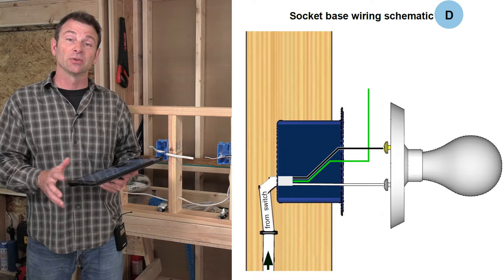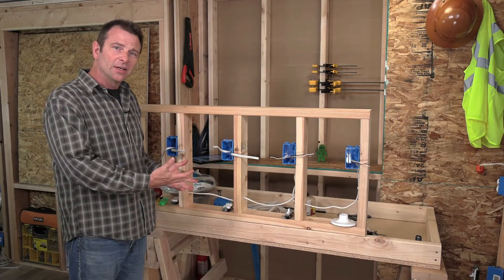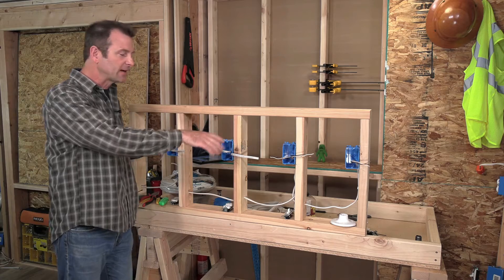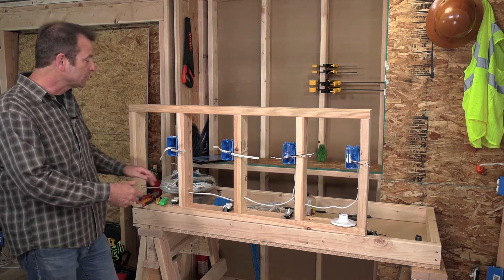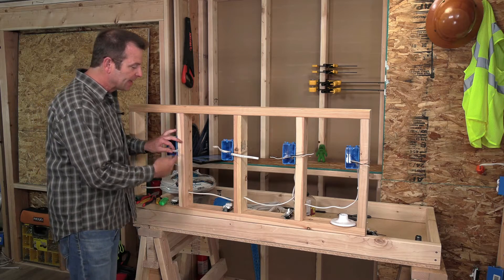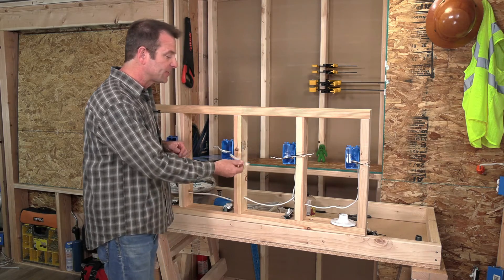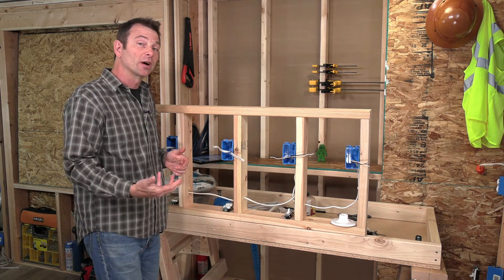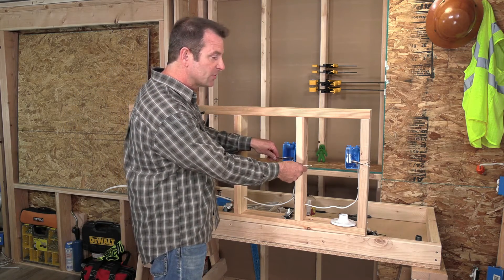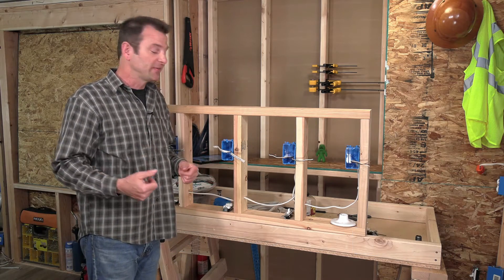Let's go ahead and do that here in our mockup. What I've done is I have a lot of this work already completed. I've set my boxes — four boxes set 12 inches up from the bottom. I have all my 14-2 cable routed in and I have a wire running in that's my feed. Then I have a 14-2 cable running from one box into the other box, with some extra so that we can work on our devices and then pack them in at the end. I've already stripped the jacket on these wires and will get down to prepping the wire ends for the devices.